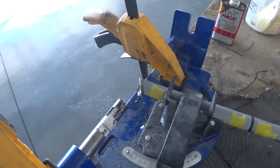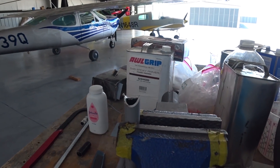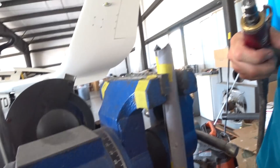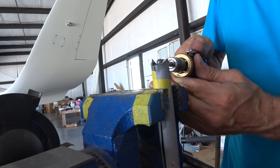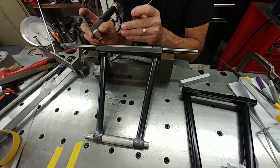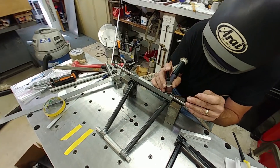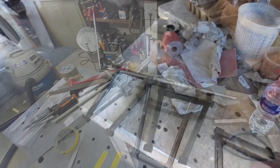You can see how hot that was getting, and that's when I broke some teeth off the hole saw and gouged the metal tube a little bit — but it was still usable. I cleaned it up by putting it in the vice and using the air tool to get the shape right. I sit a short bit of tube in there to make sure the fish mouth is a nice decent fit. Brit likes good fit and finish when he welds it so he doesn't have to fill big gaps. One of them had a little bit of a gap, but anyway — up at Brit's now. He set up a little jig with some spacers, got the two arms welded up first, then tacked the ends for the square cross brace. He got it done by Monday afternoon.